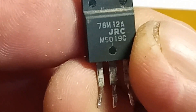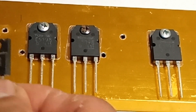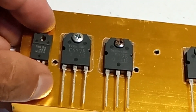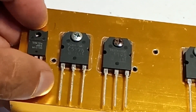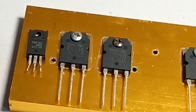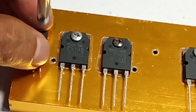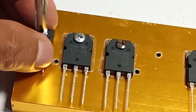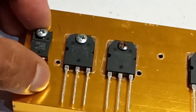Pin configuration for the TO-220 package: 1. Input — pin 1, connects to the input voltage, 14 volts to 25 volts. 2. Ground — GND, pin 2, connects to the ground. 3. Output — Vout, pin 3, provides the stable 12 volts output.